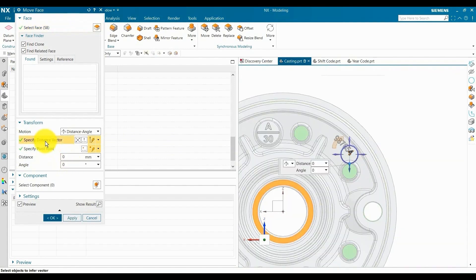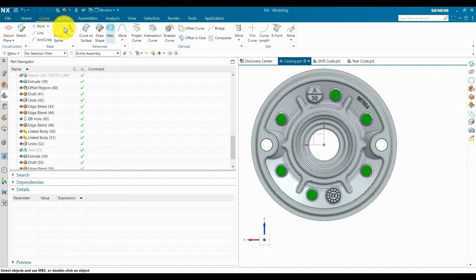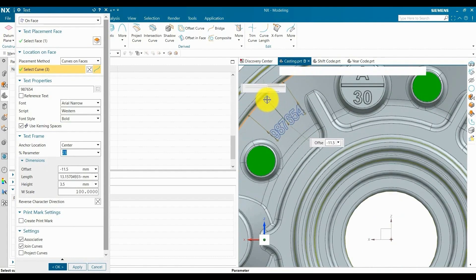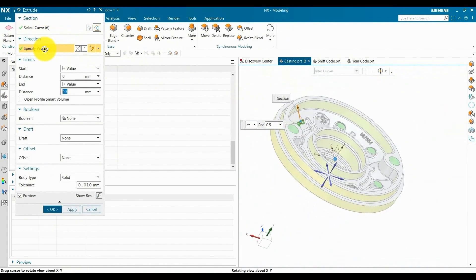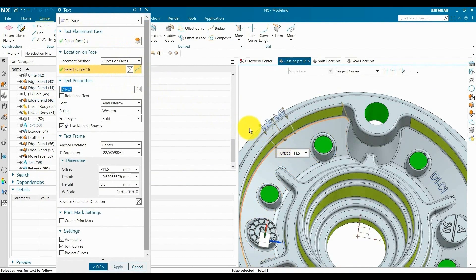You can see the 4 and the 5 are very close, so we are going to offset this using move face. This is at an angle, so we use the angle to move this pipe. Because when we use an electrode, the text is engraving upside — raised on the electrode. So we need to pass the cutter to manufacture the electrode, and we need at least a 0.4 to 0.5 gap between them. Similarly, we are going to create the die number — we use D1, and for the cavity number we symbolize C1. This can be changed according to the customer, or you can propose this, and it is done after customer approval.